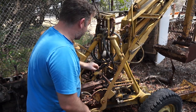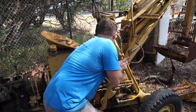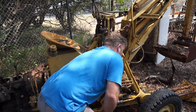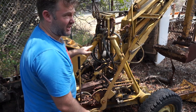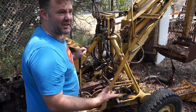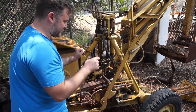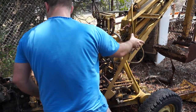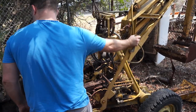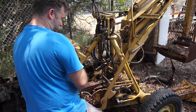There's also a foot brake pedal. When I press that, both the cables are free. On this side I'm not hearing anything, but the other side I'm actually hearing the sound of the insides of the brake system moving at least — whether it's just turning a cam which isn't actually turning stuck brake shoes, I don't know. This side did sound a bit solid, but we'll soon find out. This is the steering lever — at the moment it's hard left, so it was forward for left, backward for right, and it locked in the middle.